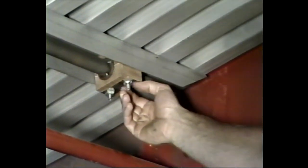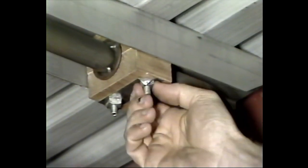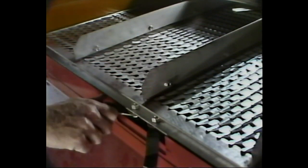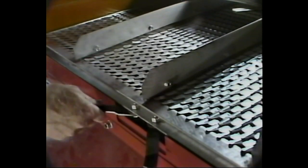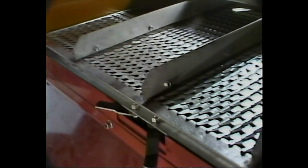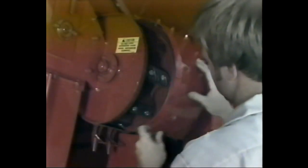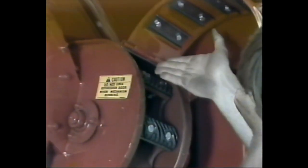The remaining steps to adjusting and inspecting the combine's internal components include checking the bolts on the straw walker bearings and walker pan to make sure they're tight, making sure the curtain on the front of the grain pan is seed tight, moving the sieve adjustment levers back and forth to see that they work properly and that the sieves open evenly and fit tight. Check the tension of the clean grain and return elevator chains. If they don't fit snugly on the lower sprocket, loosen the bearing plate nuts at the top and increase their tension. And finally, checking the rotor of the return cylinder to see that it is properly installed and that the rasp bars are in the proper right-left arrangement.